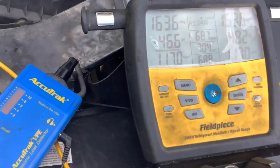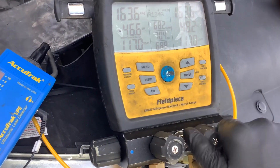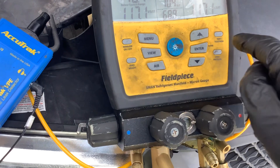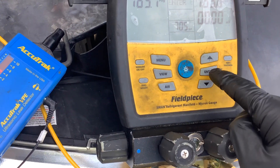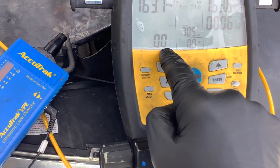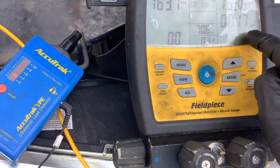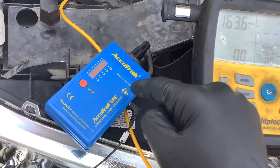Another thing you can do — I forgot about this — is the nitrogen pressure decay test. You turn off the nitrogen by closing the valve to the nitrogen tank. Watch the pressures. Now we have no nitrogen, this valve is closed. These valves are open to the system. Now: Tightness Test — press enter. It'll tell you how much pressure you drop in tenths — you see 0.0. This is so sensitive it reads tenths of one PSI in decay. And here's the timer counting down telling you how long you go and what the difference is — how much you've lost. I'll be back after I zero in and find this.